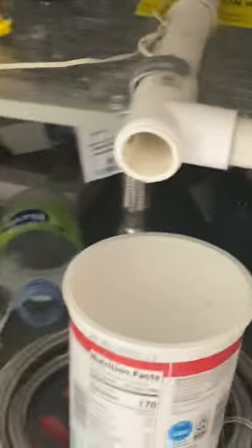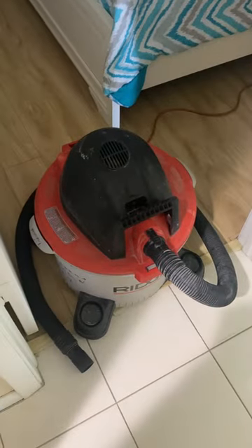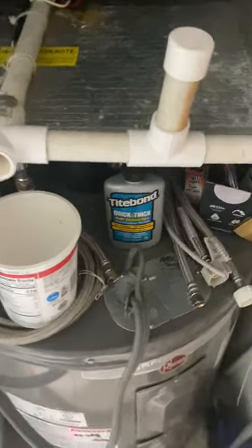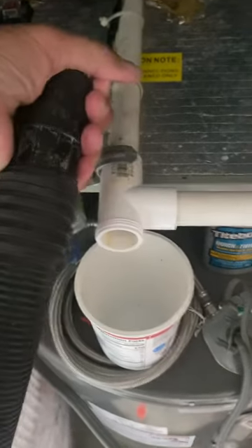I'm just doing this for demonstration. I have a shop vac and I suck that pipe out. The important thing with the shop vac: make sure there's no filter — you're just using it for liquid. You should be able to open it up, see the float, and then I just take the hose. I use my hand to restrict the airflow a bit and put it over top of that hose to suck out the pipe.